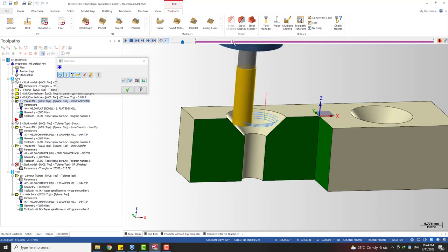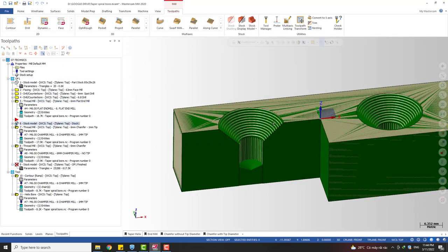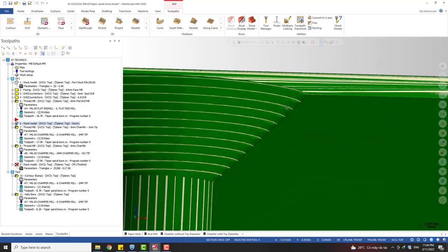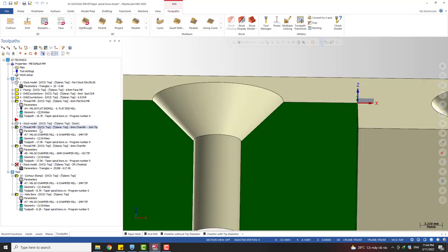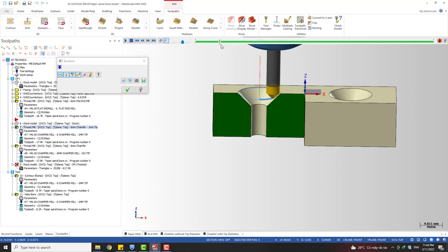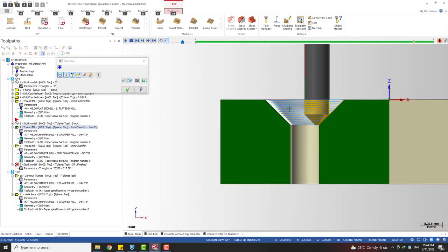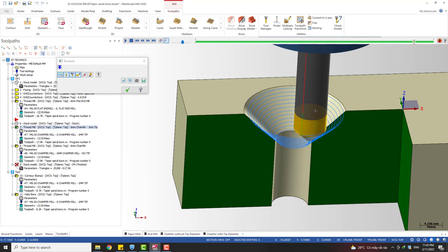Yeah, this is a flat end mill and I can use this for roughing the material. And this is what it looks like after the first toolpath. You've got some material left on the countersink surface here, and after that we use the same toolpath but just switch to another tool, and we can use a chamfering tool for doing the finish. Yeah, like this, very nice, right? You can see we have a ramping toolpath from top to the bottom with a taper angle. And of course the taper angle in this case is both the countersink angle and the angle of the tool. Okay,